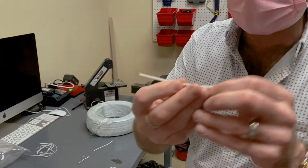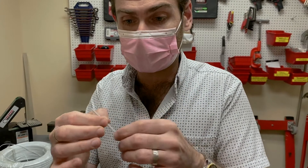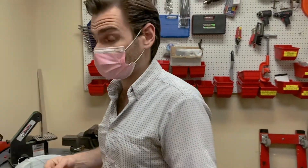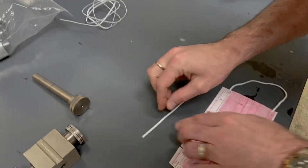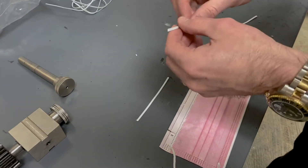The nose wire in the mask we're using now was designed in China — we kind of had a platform that was developed there and we're trying to improve it. If I take this nose wire out, you're going to see it's a three-millimeter extruded wire. What they do is take a galvanized wire and extrude some plastic around it. We get a bunch of our nose wire from Mexico — it's one of the parts we don't plan on making here, because I don't want to deal with metal. It is a really single extruded piece of metal, and it's very, very flimsy.